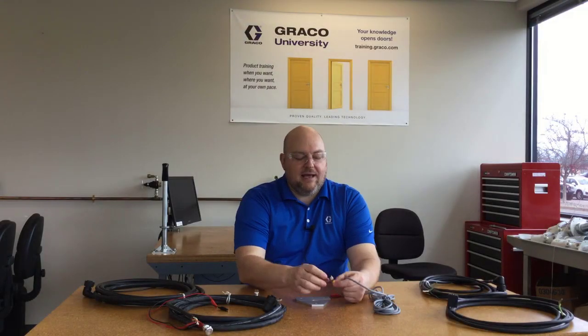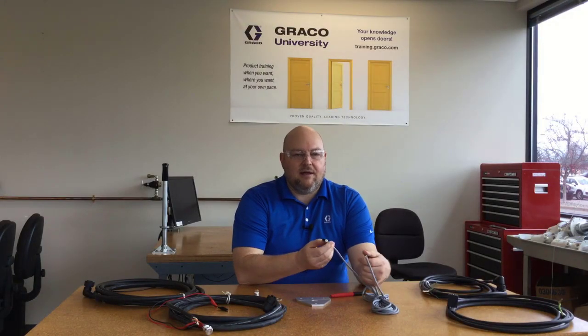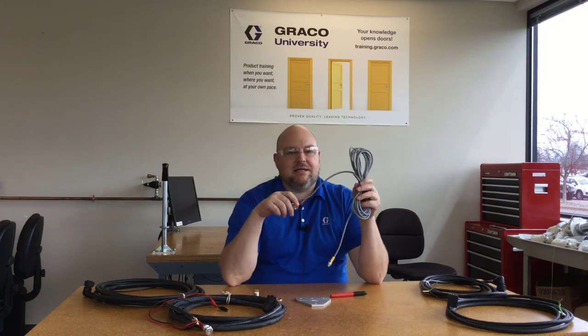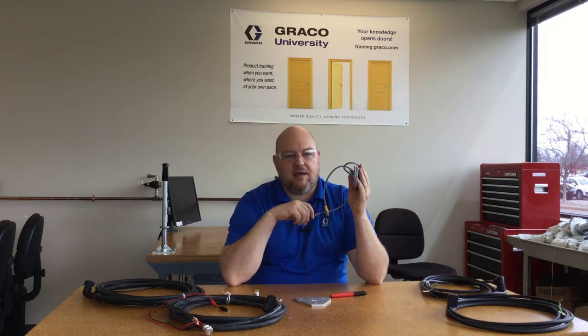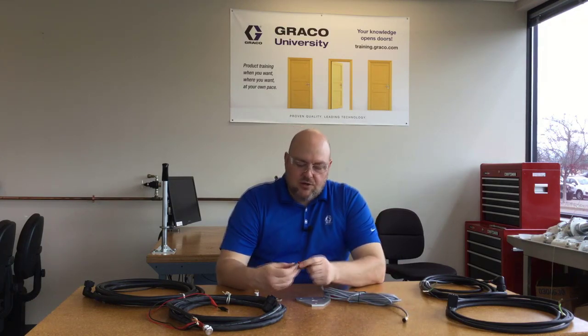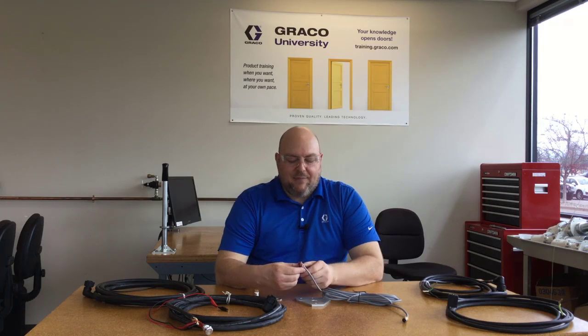For the M12, blue is on three — we couldn't be consistent there. The M12 connector has pins one, two, three, and four, and you'll see those pin assignments for the different colors in the different manuals for the G3. The cable that comes with these kits is just the 1-2-4-300 cable that we've been selling for almost a decade.